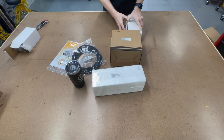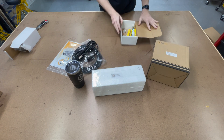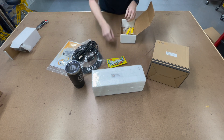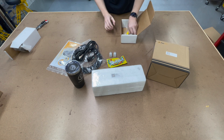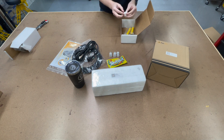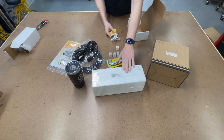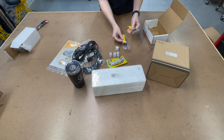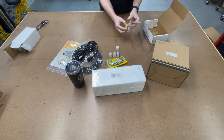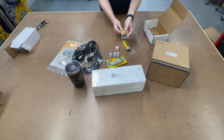There's another box here with some additional supplies: the power cable, some Skittles of course, ER11 collets in 1/16th, 1/8th, and 1/4 inch sizes, as well as the PwnCNC collet nut for the spindle. Since this is a 1.5 with an ER11, everything here is ER11. We've got a 17mm wrench — a nice thick steel wrench that works with the nut — and a 13mm wrench for the shaft of the motor.